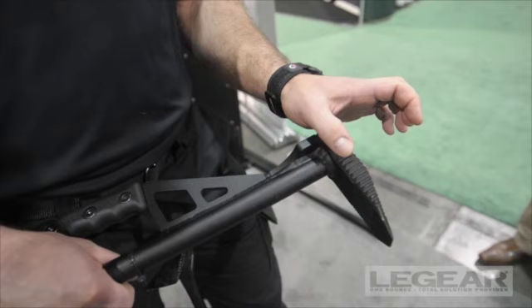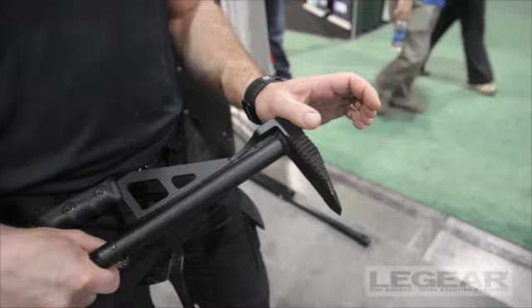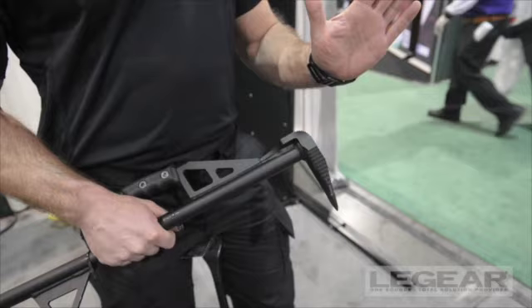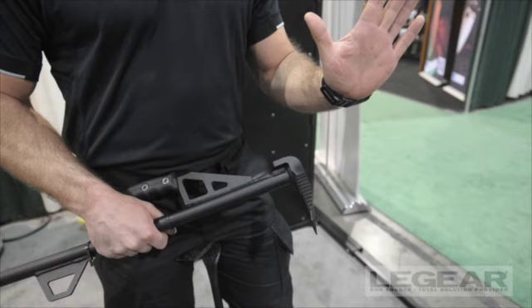So you would have a gap like this. They explained to me that on a heavily reinforced steel door of good quality the door blade itself becomes its worst enemy. The door blade is so stiff that it won't yield. So when you force in a wedge that creates that wide a gap, the door blade becomes like a spring feather and starts breaking itself — breaks its own locking points.